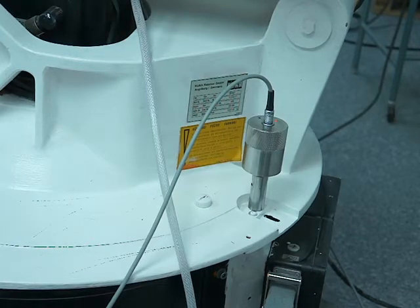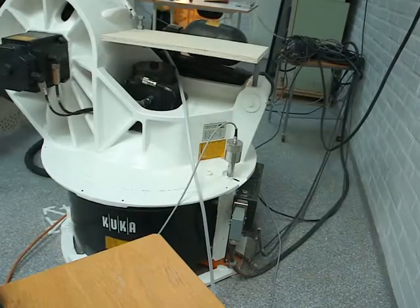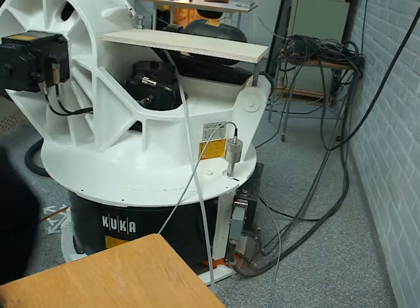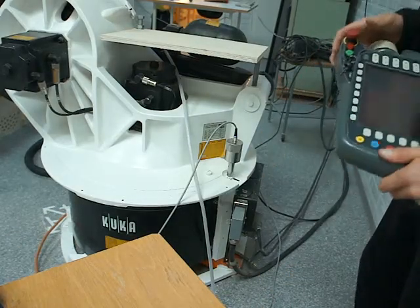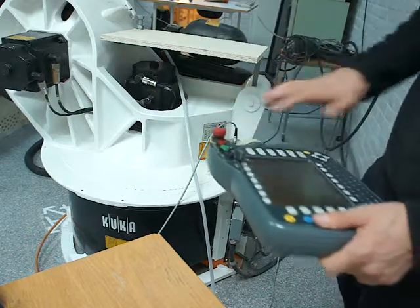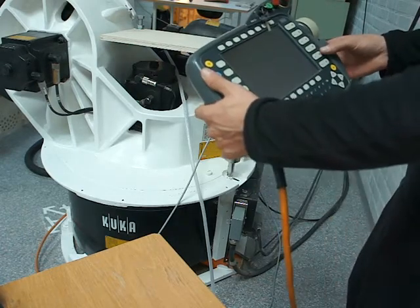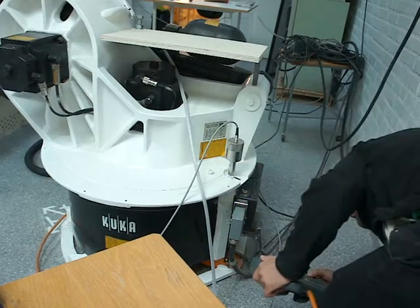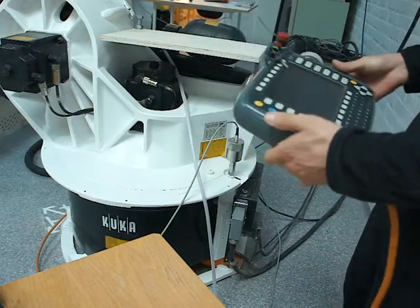It says EMT mastering distance exceeded, so it didn't succeed in mastering. We need to run again. I'll just check that it is actually aligned — it was a little bit too far from my alignment. I'm of course doing everything in T1 mode. Always use T1 mode if you're close to the robot and using the console, and nobody else can be within the robot area while this is happening. I'm holding the dead man's button and just turning axis 1 to align.